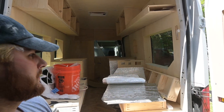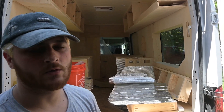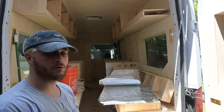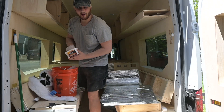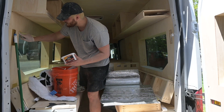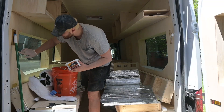We're going to fill in any holes from nails or knots in the wood to give us a smooth surface to paint on. Once we sand everything down again — we already went over it with 180 grit sandpaper — I was filling cracks with wood filler, but wood filler doesn't hold up well in cracks, so I caulked the cracks and used wood filler just for the holes.